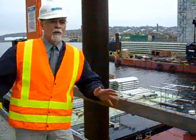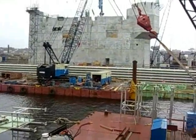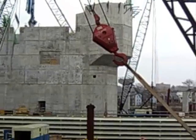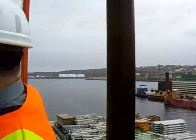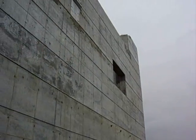It's about six feet wide, and this protects the bascule from shipping. If you look on the outside, you can see there are rub rails on the other side, and behind that is six feet of concrete. There are pipe piles that go all the way down to bedrock on both sides that support this structure. There are also protection cells on either side, completely lined with steel, filled with stone, and capped with concrete. This acts as protection for both fenders.